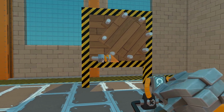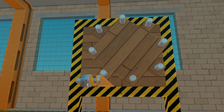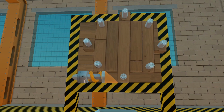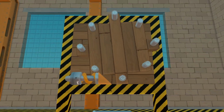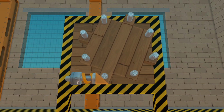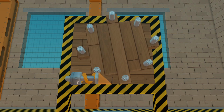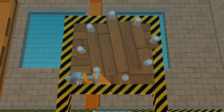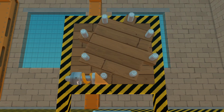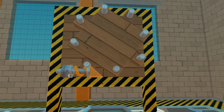Now we want to have a look at the ratchet itself. This is the design I settled with, and I'm really proud how good it works. So I'm having an engine here. I'm rotating this gear into one direction and pushing the suspension back. But in the moment I will change direction, it stops because it can't get past this wedge. It's blocking the way, and it's really working pretty reliable. Sometimes it's skipping a tooth, but most of the times it's really reliable. And I'm very happy how well this works.